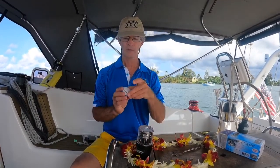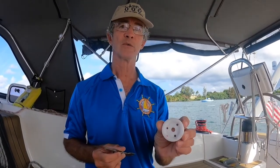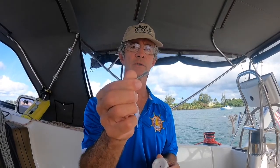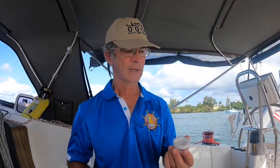I took this solid block of plastic that they provided as the base. It has a hole where the wires from the mast come up through, and there are three screw holes. I wanted to make room for the connectors, so I took a one-and-a-quarter-inch wood bit and drilled out approximately one centimeter of this base, which made room for the connectors to lay. When trying out the screws that came with it, the screw heads were hitting and not going down all the way, which impedes the space for the connectors. So I used a Dremel tool with a cutting burr, and that drilled out just the perfect little space on each of the three screw holes for the screw heads to fit down flush — giving me enough room for the connectors of the wire.